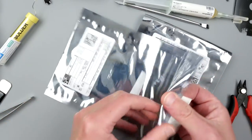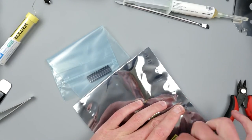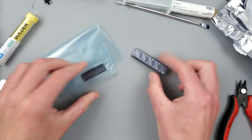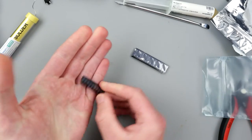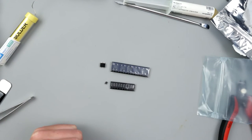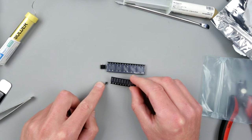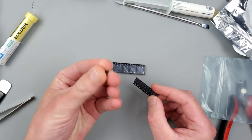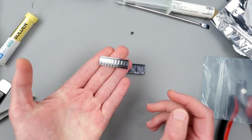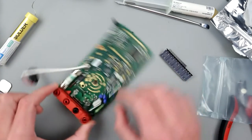Let's open the bags — it's a bag in a bag! The replacement tiny diode is a GF1 or similar — different part number but same specs, so it should be fine. This is a general purpose diode, nothing really special. I got a bunch of them and five of the bridge rectifiers in case I need them for something else. So let's take our multimeter and replace those two parts — first the diode because it's in a finicky spot, then the bridge rectifier.